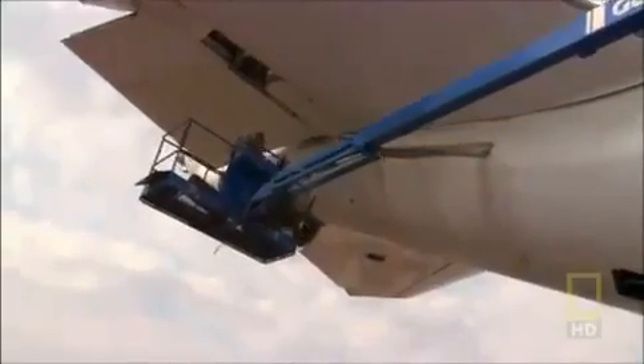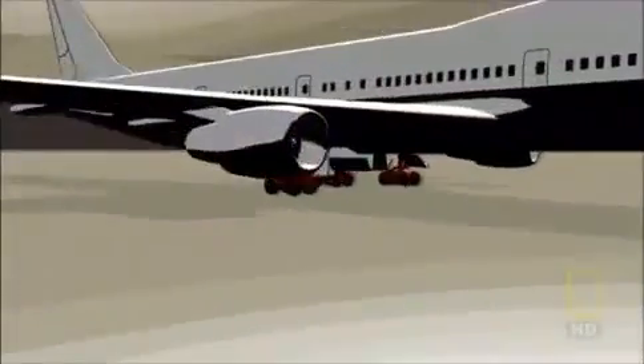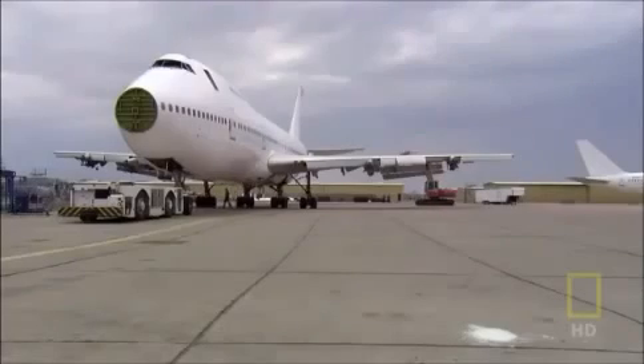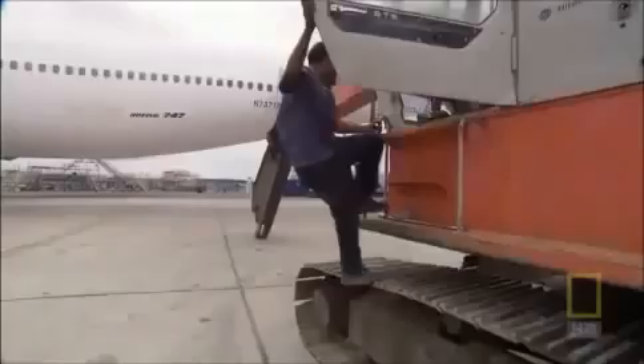The mechanics have now gone inside, outside, and up high to salvage valuable airplane parts. Now, for the first time, they look below. Five sets of landing gear extend from the plane's belly and wings — they must be removed, but the question is how, while still keeping the plane up and balanced. With so many components already removed, the 747's balance is off. Roger has a solution: he decides to cut off the tail, calculating this should stabilize the CG, or center of gravity.